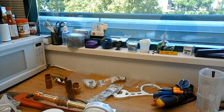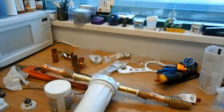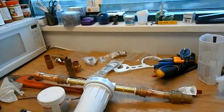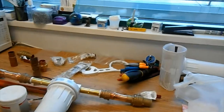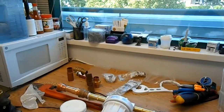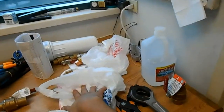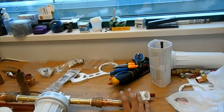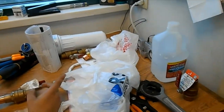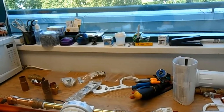So what we were having happen is the condensers were getting full of sand, and the units would trip out on high pressure, and then we get the tenant calling us and we've got no air conditioning. I've backflushed them a number of times, and we still have it happening. So until we get all the sediment out of here, we have to use a filter like this. And I have another assembly for a 4-ton unit, with a 1-inch water supply and return. That one's about a 2.5-ton unit, and that's 3/4. But basically, I'm going to do the same thing there.